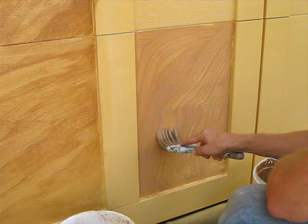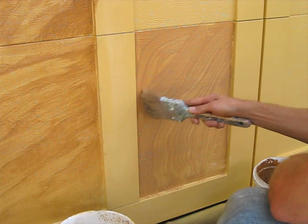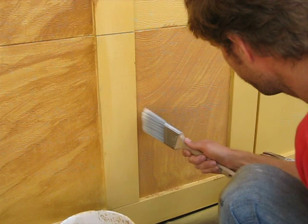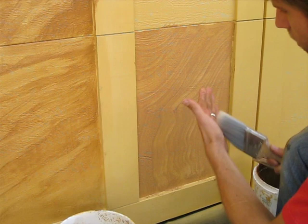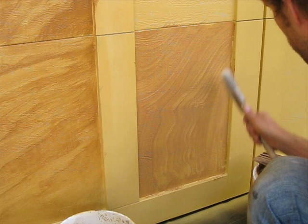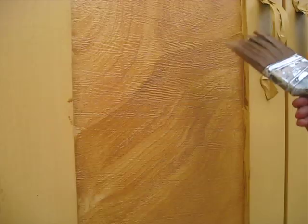I'll zigzag it a little bit — do some stuff like that, maybe go up like this. The next tool I'm going to use is a dry brush — just the same kind of brush, but dry. I usually let it tack up a bit before I start. The strokes are light, really light, and you're catching it with the edge at this angle. You don't want to get it with the tip — that digs in too much. Light and quick, because you don't want to pull that too much; it'll ruin your texture.